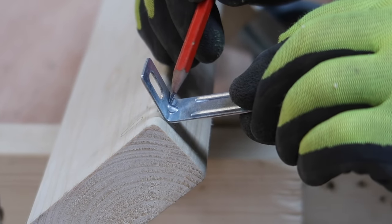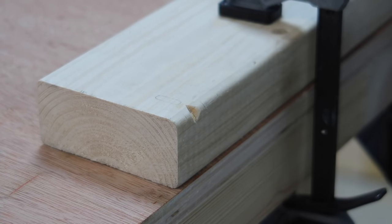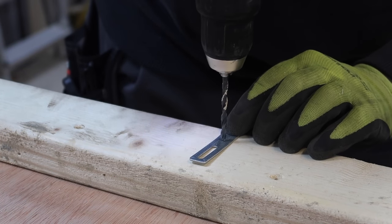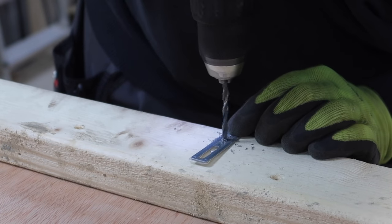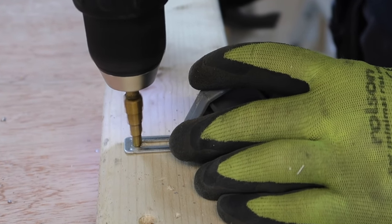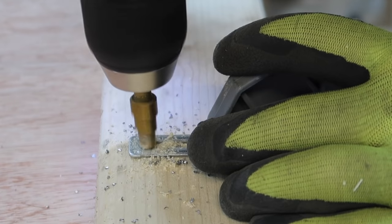If you haven't been collecting brackets for the last 20 years, these types are really easy to find in DIY shops and come in lots of different shapes and sizes. I wanted a secondary fixing in the side of the bracket, so I drilled an additional hole, which is easily done with an HSS drill bit. I also widened the bottom of the slot with a step drill so the head of the screw I'm going to use as a latch easily fits through it.